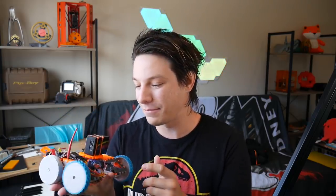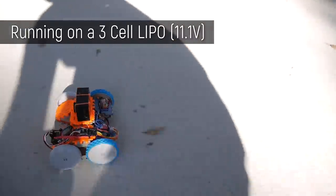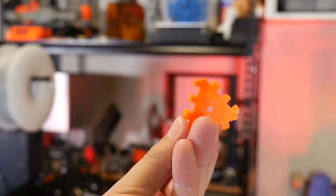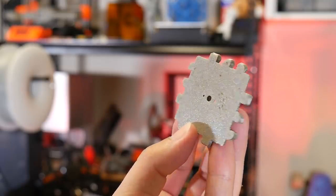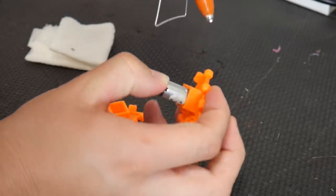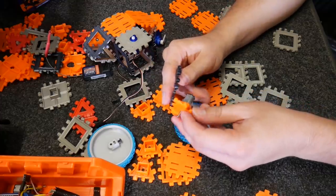These frames, although they're plastic, once you start adding components they start to get kind of heavy, so I wouldn't go anything faster than 50-to-1. It's already really, really fast. These fit into the little motor mount panels, either the triangle or the square one. I have designed them with the ability to use two front-facing mounting screws, but these are M1.6, which is very uncommon and very hard to get. So in this application, press-fit and maybe a bit of hot glue is all I did to hold the motors in place, and it seems to work very well.